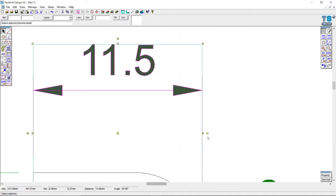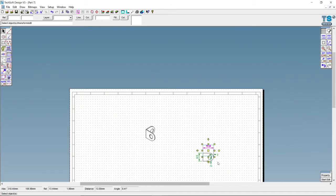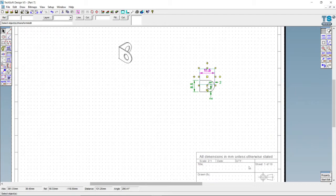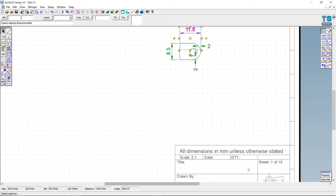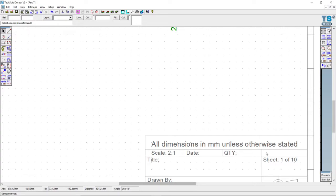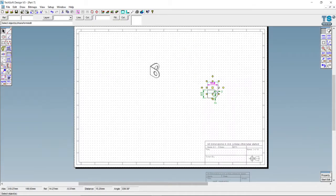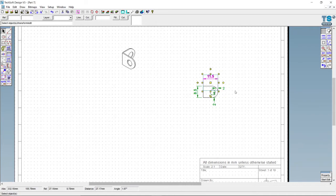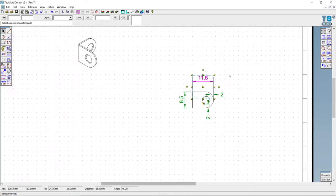And I'm gonna add that later on to the title box here, where we're gonna put the tolerances in. I'm gonna measure up a few identical parts and find out what the maximum difference is, but at the moment I think we're looking at a tolerance of plus minus 0.5 millimeter, which is quite a lot in many ways, but I said this is a toy, not a high spec part for an iPhone or an aeroplane or a racing engine, so that's acceptable.